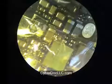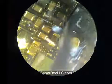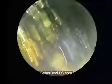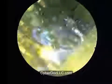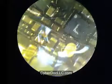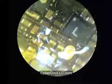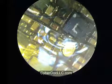Again, you always want to supply the flux. Once the flux is dry, you are running dangerously at a higher temperature than you wanted for the solder to flow, getting into the range of damaging the components. Flux serves almost as a temperature buffer to absorb the excess kinetic energy from the heat gun. Hence, the temperature will only rise as high as the flux vaporization point. And this particular flux vaporization point is just a few degrees above the lead-free melting solder. So it will vaporize at 270 degrees Celsius.